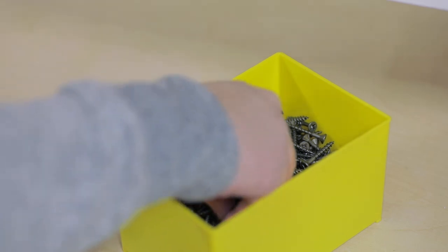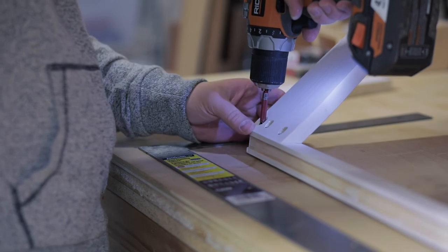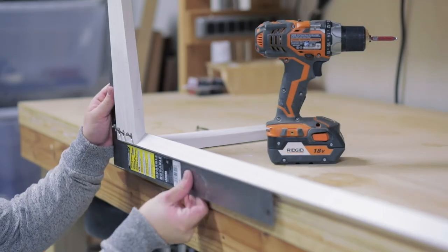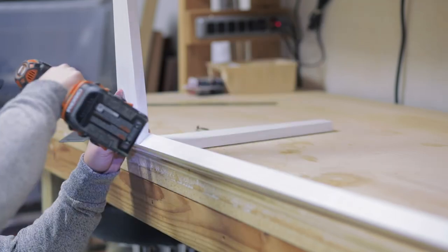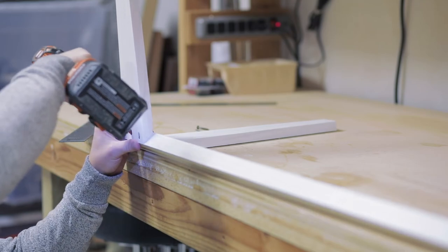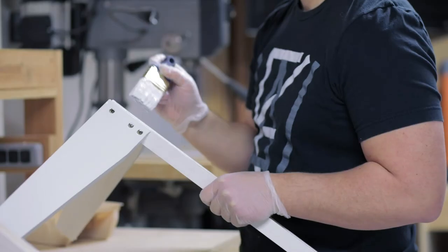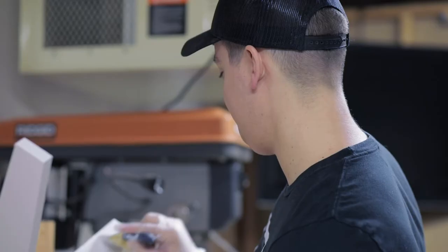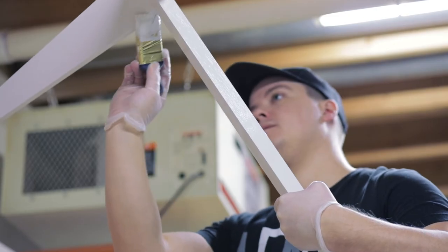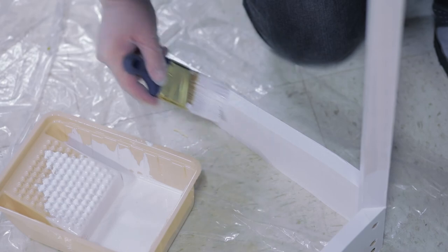This design is a little bit awkward to screw together because the pieces meet at an angle, but overall I was able to get it done without too much of a hassle. Just know that the slightest degree of rotation in the leg is going to have a pretty big effect on how straight the whole thing stands. I had a square that I used to make sure I was locking in the legs as close as possible to 90 degrees. After assembly I set up for painting and did one coat of white paint. I used the same trim paint that I use everywhere in my house and it ended up looking really fresh.